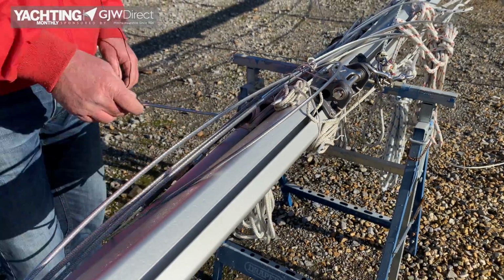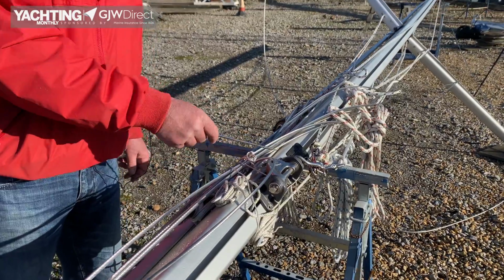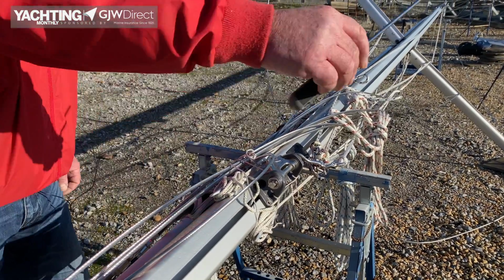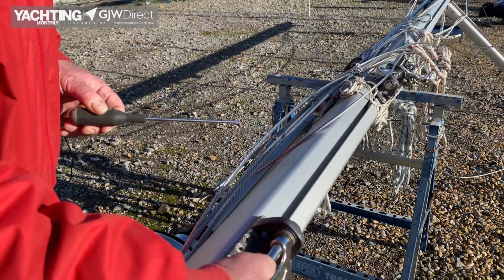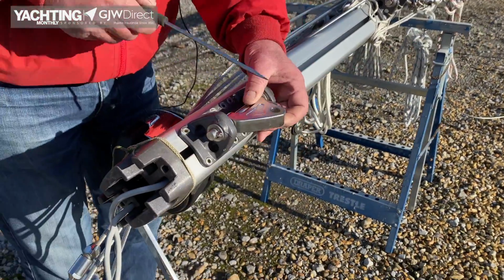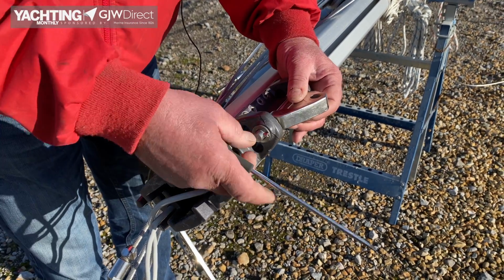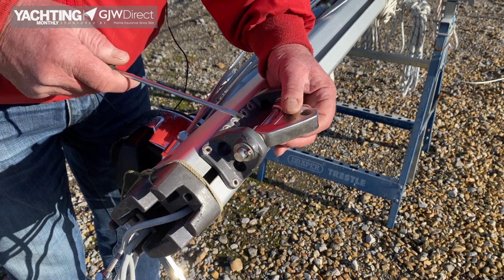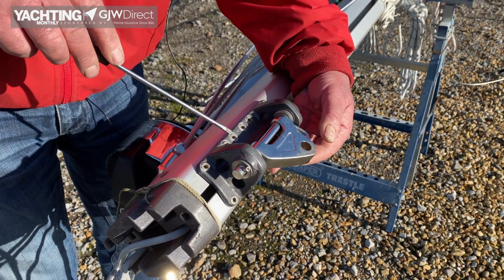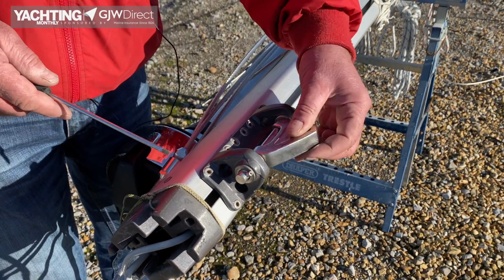So moving on down, so that's a high load area. When you think about the loads on the boom and jibing and the tension from the kicker. So it leads us on to the kicker. Same thing, same toggle, same bracket, high load. See, this one does move a little bit, but again, we're not worried about that. This is a casting after all. So then check all the rivet heads are on, check there's no evidence of lifting because of the load that's been applied.